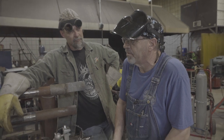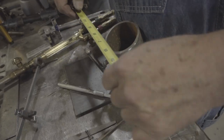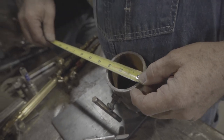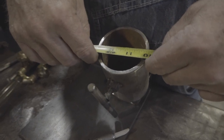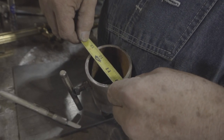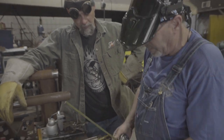Actually, we want it just a little bit bigger than 3-inch. We want it like a corner-to-corner fit. So for example, this is a piece of 2-1/2-inch pipe — we know that this is 2-1/2. When I measure something like this, I'll come in here and I call it burning an inch. I want to be accurate. I don't want to hook this thing because it's okay for quick stuff, but that doesn't really get me accurate. So I want half of this wall thickness. I'll come in here and read it. That says I'm a 16th into this — this is 3-sixteenths wall thickness. If I want to make a gentle corner-to-corner fit, then I come in here at 3/32, and it's like 2-1/2, and there's 2-5/8, and it's not quite to 11-sixteenths. But if I go 2-5/8 heavy, then I'm corner-to-corner. So let's cut that — let's lay out for 2-5/8.